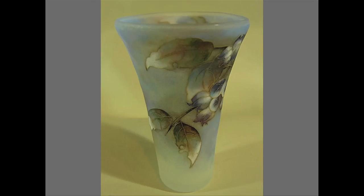Although there are no records of the specific processes used by the two early Japanese glass substrate makers, interviews provide insight into the contemporary makers' methods. Unlike the two earlier masters who, as far as is known, deposited unmodified cloisonné enamels on typical commercial glass, these recent Japanese makers have succeeded in part by altering either the substrate glass or the applied enamel so their chemical formulas are more alike, thus creating similar coefficients of expansion. The specific formulas are kept very closely guarded secrets. In general, the contemporary process first requires making the glass substrate, usually in the form of a cup, bowl, or plate over a mold. The glass is fired upside down at varying temperatures of about 800 to 1,000 degrees centigrade, specific to each maker. Very thin, pure silver wires and enamels are then added to the glass surface, often while the mold remains in place. Bisso, however, frequently does not use the mold, relying instead on the strength of the glass substrate they employ.